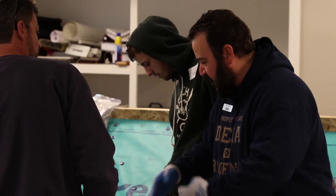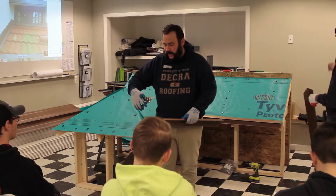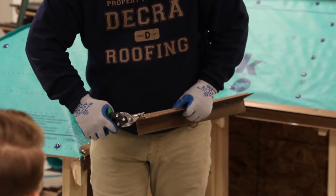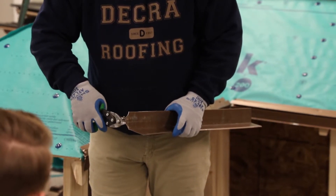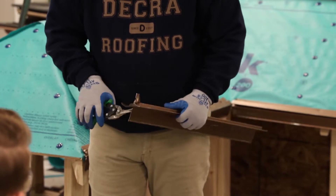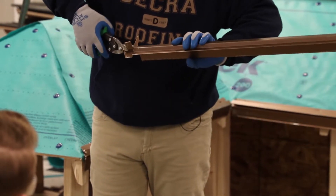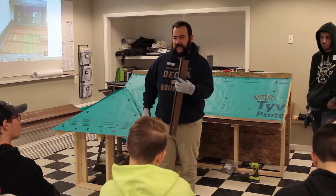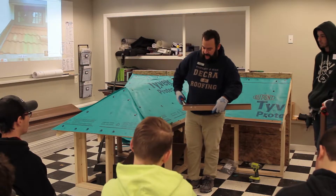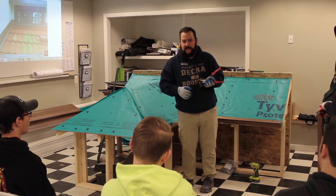We're going to want to bring this all the way in, just like we would run drip edge on a roof. We can do the same thing on the ends — we'll wrap it right around the corner. The way that I cut this, one of the reasons I use reds and greens is because depending on what you're using, it's going to snip the metal up one way or the other. If I cut with my reds here, it's going to peel the metal up this way and make it easier to work, instead of binding up on the other side.